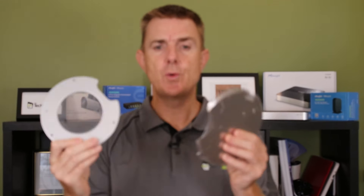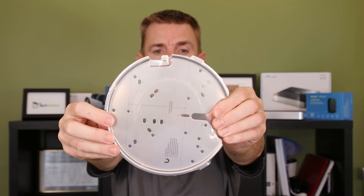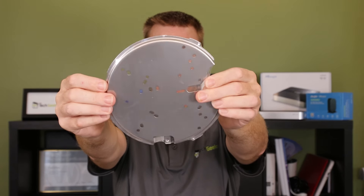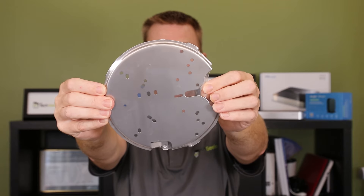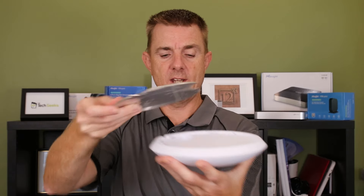Then you're going to get your two metal plates. This is the metal plate that's going to be fitted to the ceiling. This is designed for a whole bunch of the different Ubiquiti access points, hence all the different drilling holes. You mount that up onto the ceiling and then bring your device up and circularly clip it into place — that's how you mount it onto a hard surface.